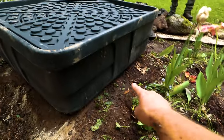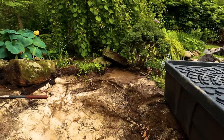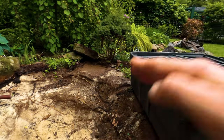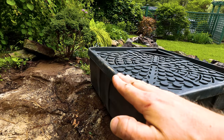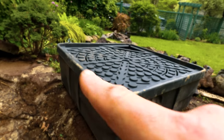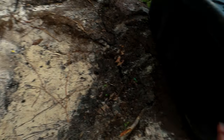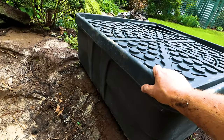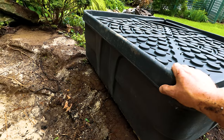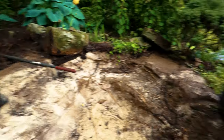We're sinking the top about four inches below grade. This lets us extend our waterfall to about the halfway point, and since it's below grade we can use stonework and gravel to completely disguise it. Tree roots are not an issue — this is heavy-duty molded plastic, so no underlayment is needed under the basin. We will lay fabric underneath our liner up at the waterfall.